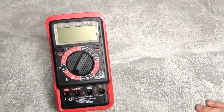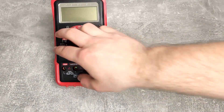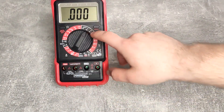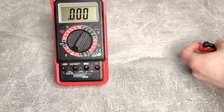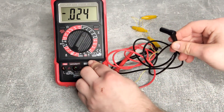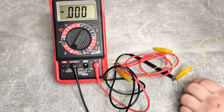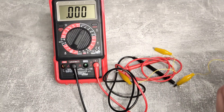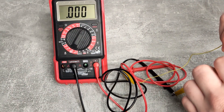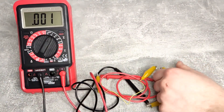Now let's experiment. Here I have a regular multimeter, and all we are going to do first is measure the voltage of one LED. Let's turn it on. I'm going to set it to 2 volts maximum. Now I'm going to take an LED to measure, and of course the probes. The shorter pin on the LED connects to ground via the black probe, and the red one comes to the longer pin of the LED.